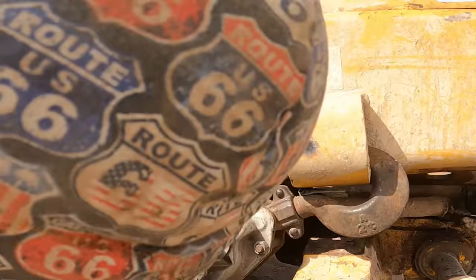Now, I normally talk about not liking fish plates or plates that go on top of other welds. I'm not going to do that here, but I may put one lengthwise underneath, because then that'll become a tension pull instead of one that's flexing like a boom on an excavator. That's just too much force, in the sense that it's not allowing the boom to flex. Here, most of the problem would be these guys want to pull apart this way. So maybe I'll put a piece of flat bar of some sort under there just to help strengthen it up. So this side's looking good.